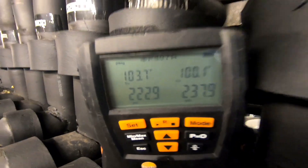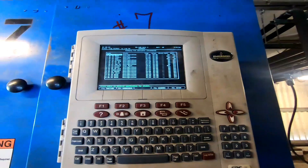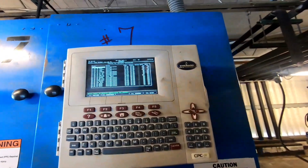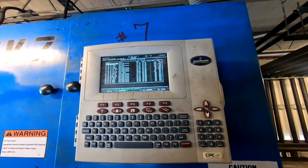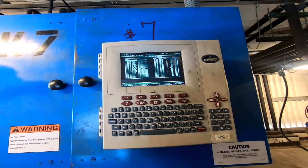The differential is about 15–16. We're in drip mode — the case just came out of defrost. We have an 8-minute drip to let the water run off the coil before it turns back on.